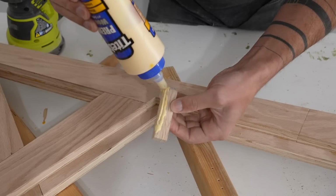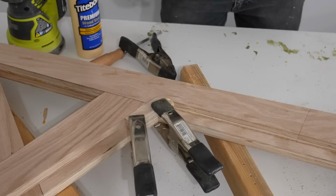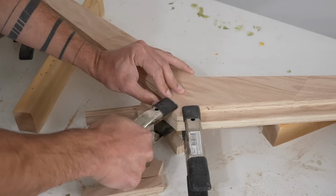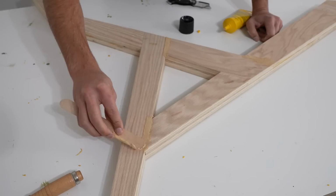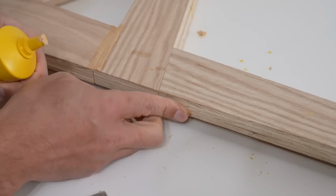Now I could cut plywood at an angle and have a completely continuous surface, but I thought that might be a little too angular, and so I CNC'd out these little spacers for these angled joints. I love how precise my X-carve Pro is, but I did go in and fill in these tiny little hairline gaps with some Minwax wood putty.